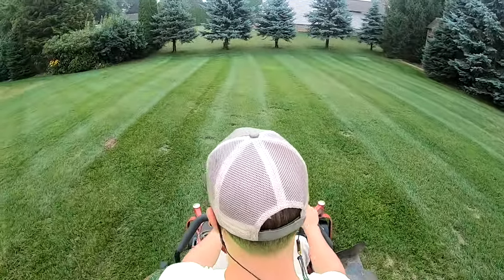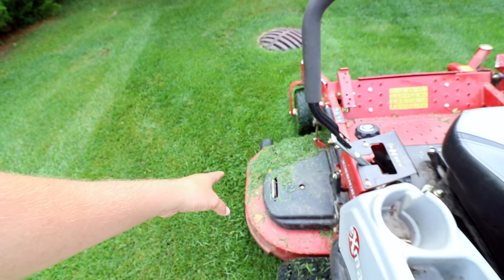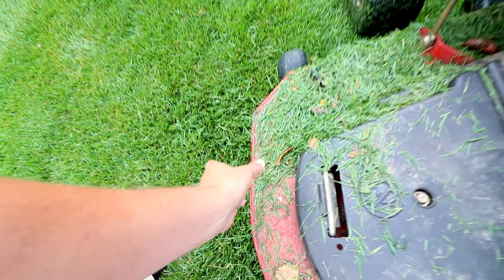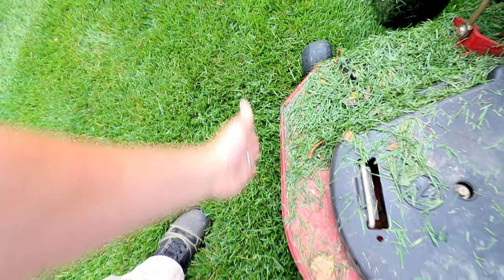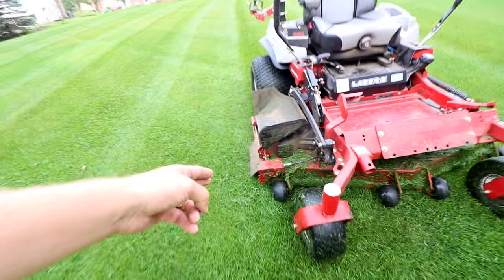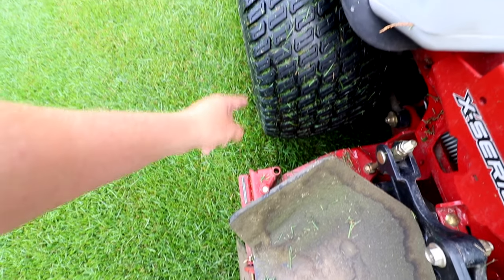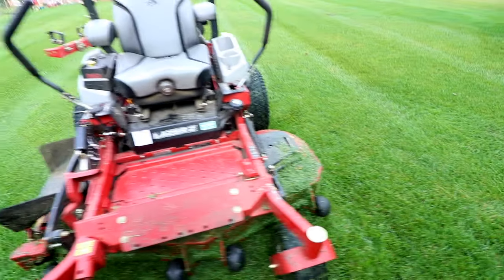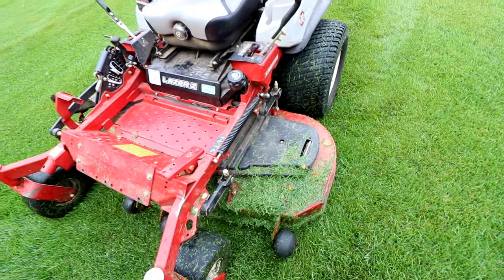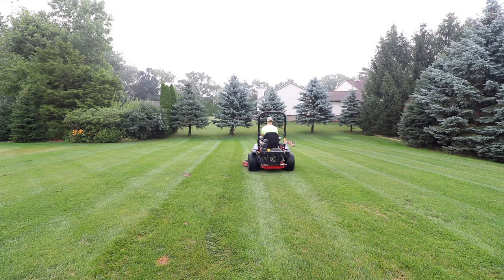For example, let's say you're in the seat — and this is the same thing if you have a push mower, a stander, or a zero turn — when you're coming down the line, it's almost like this is hanging out of your peripheral vision. It's almost like you can't keep track of where the deck is, that's how close you have to make that tip. So if this line is cut grass, you want to line it up to literally where you only have an inch of grass going under the deck. It's got to be almost perfectly edge to edge. The blade tip is about an inch longer than the wheel width. So you don't want to line up wheel to wheel, which is what I always used to do. On a zero turn, you want it to go tip to tip, which is deck edge to deck edge.